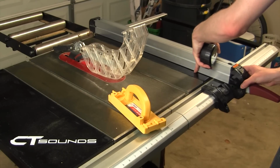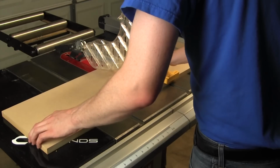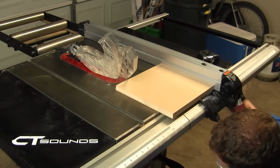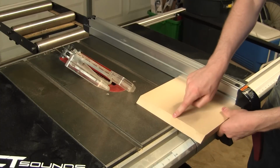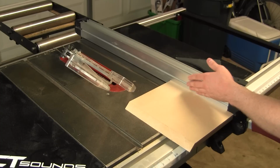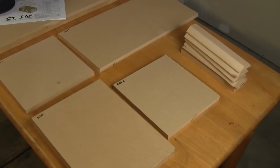We continue to cut the pieces for the sides of our box along with the two port pieces and the brace. With these pieces complete, we will then adjust our table saw blade to 45 degrees and make a series of cuts, creating our corner 45s along with our port end brace piece. For cutting the 45s, I make a pass, adjust the fence towards the blade the width of our 45, flip the board, and then make another cutting pass. We are now finished using the table saw.